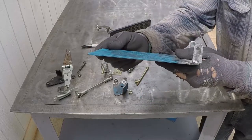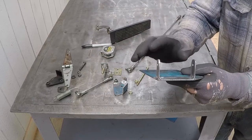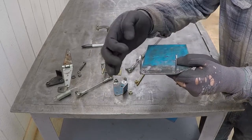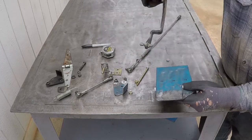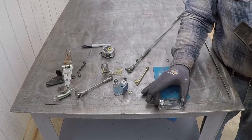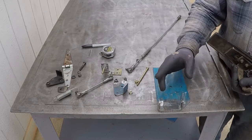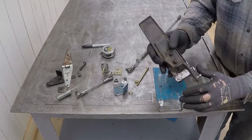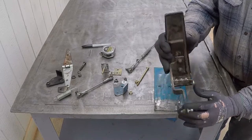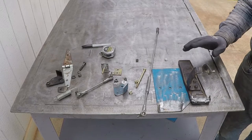I took this 1/8 inch flat stock, about 3 millimeter thick, everything 3 millimeter or 1/8 inch stock. And I welded ears over here, drilled to the same shape. And I calculated how far I need from the floor before, because the floor mat will come here, so I want this to be above the floor to prevent dirt from getting into the surface. And this worked great. I also cleaned all the parts. I'm ready to paint them, and then I'll take them and try them out.